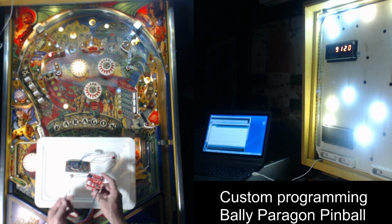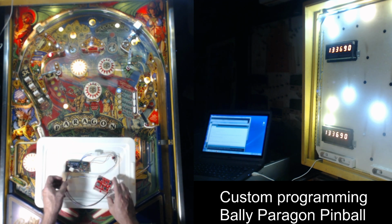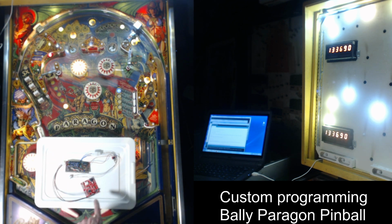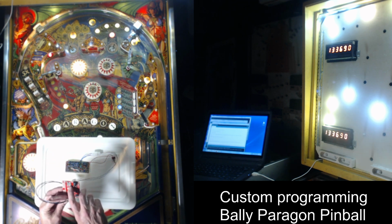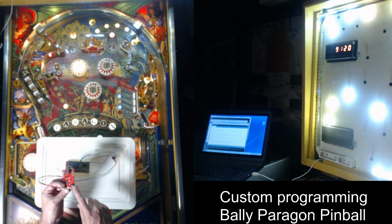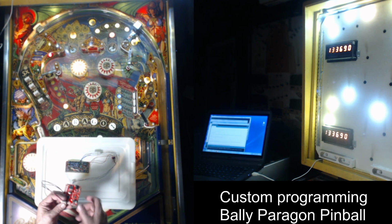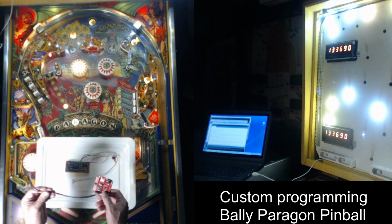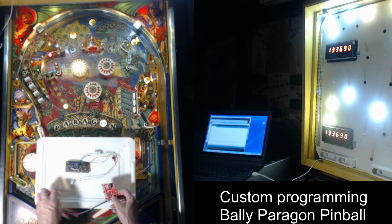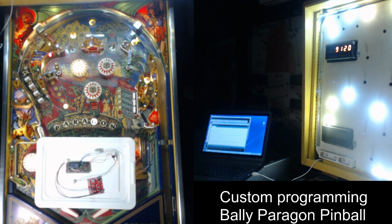And this is communicated with the Arduino over a serial line. You just plug it in, and you put your sounds on an SD card here, and you hook the 1/8 inch jack out to your speakers, and you're good to go. This thing is actually powered off of the jack here. So this basically plugs in, this would plug in right here. And these two boards, and there you have it. You completely modify the game. So there's a bunch of us that are out there working.